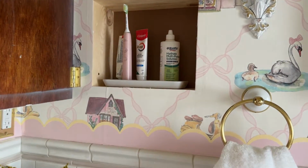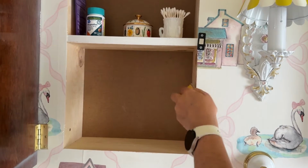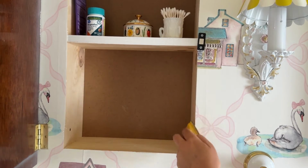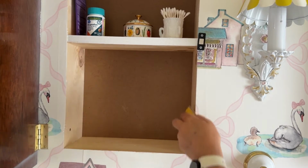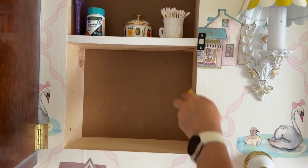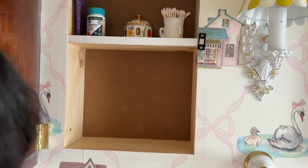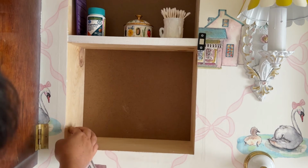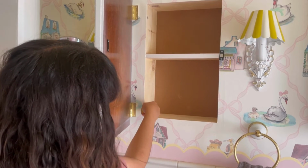That's all fine. And then one thing I discovered is that I have this small finger sander, it's called. It's really fine sanding paper on the back, and I'm using that to clean up the edge of the wallpaper. So if I get a little bit of a jagged edge or sometimes little strings come up, I'm just cleaning it up with the sander so I get a nice edge. And then I am also using wood filler in all the screw holes so that those will kind of disappear. When dry, sand the wood filler smooth.